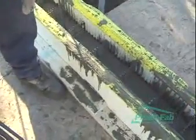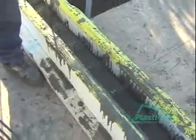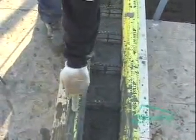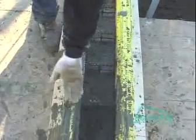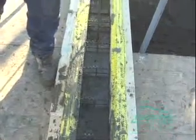As you can see, our two by fours we sandwiched on each side of the wall, making sure that the wall stays nice and straight. We taped the top — as you can see, the concrete slops all over the place — this is just to protect the interlock. We will peel this off as soon as we set our dowels, then we'll be done.